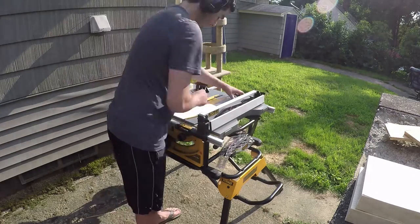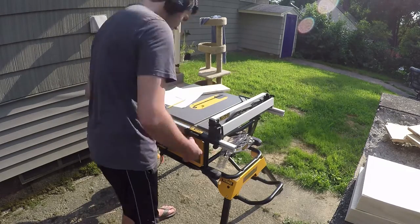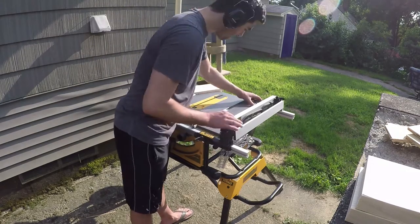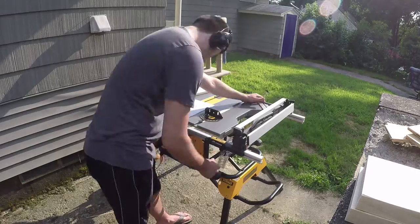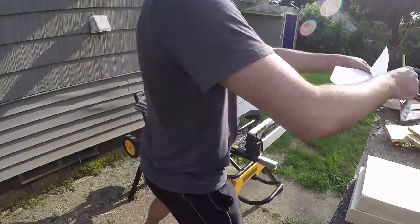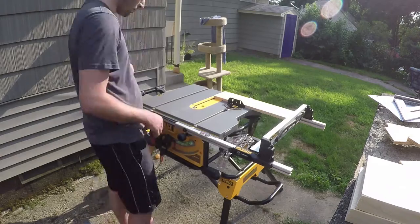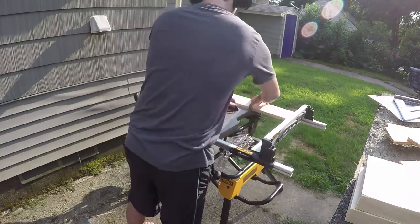In the other video I show the exact measurements for shelf spacing, but here I'm calculating that out as I cut. The easiest approach: because the spacing is symmetric, pass it through on one side, then flip the boards 180 degrees and hit it on the other side — the spacing from the ends should be the same in both cases. I work all the way down both sides to get all the slots cut, then go back and do a couple cleanup passes to widen a few that were too narrow, so the shelves all fit without a fitment that might eventually crack the sideboard.